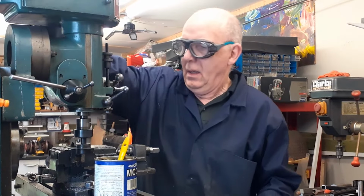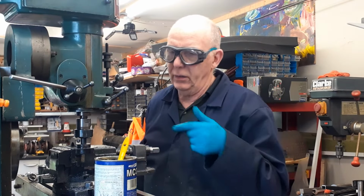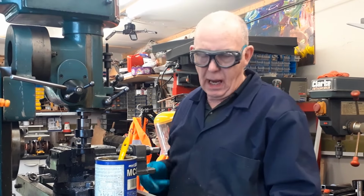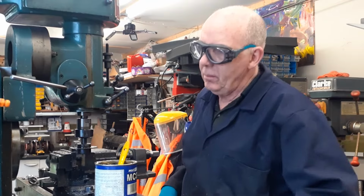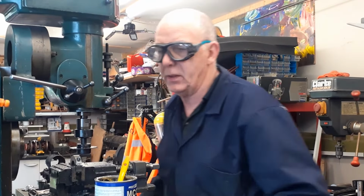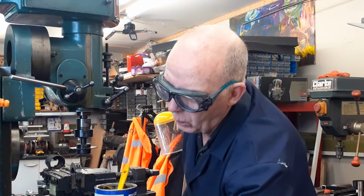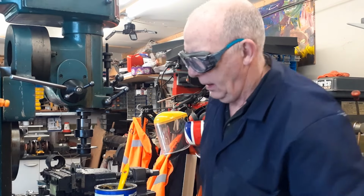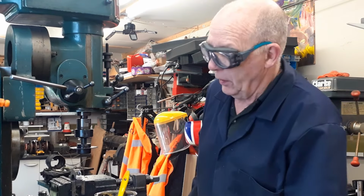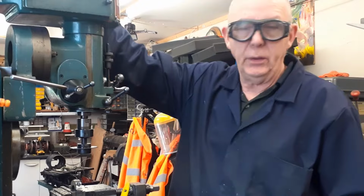Okay, that's slit. I need to do a little bit of cleaning up on the internal threads, but first thing will be I'll just tap that, and it should be relatively easy because I can just drop the tap in, it'll go in through the 4.1mm clearance hole and should drop straight into the 3.3mm hole that's been drilled for tapping. So I'll crack on and do that.